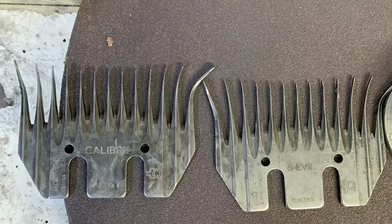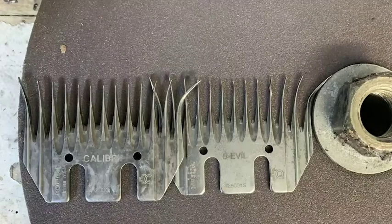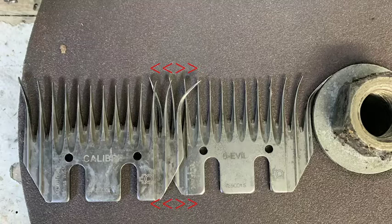Righto, so taking three teeth off the disc, this whole idea is based on the fact that two combs don't fit on a grinding disc. If I put two combs on a grinding disc, well then they overlap that part of the grinding paper, that part of my emery never gets relief or never gets a rest from the comb going across the disc. So it's going to wear out faster. That's a fact. I don't deny that at all. Let's get back to the point of taking three teeth off your grinding disc.